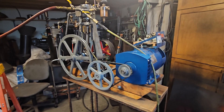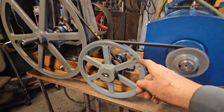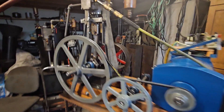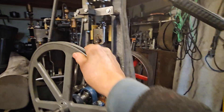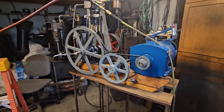Here's my next attempt to get the generator running at at least 1,800 RPM. I put on this 10-inch V-belt pulley here, but now it seems like it's really hard to turn it over. It's cold in the shop today, and I'm just running it on air, but it's just really a lot harder to roll it over than it was with a 6-inch pulley.